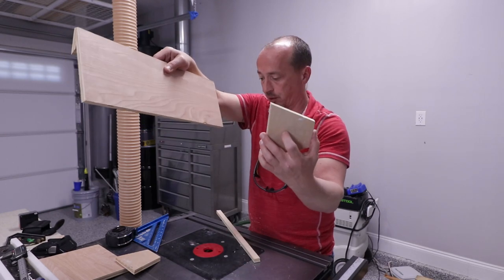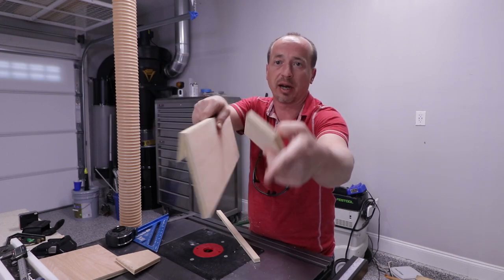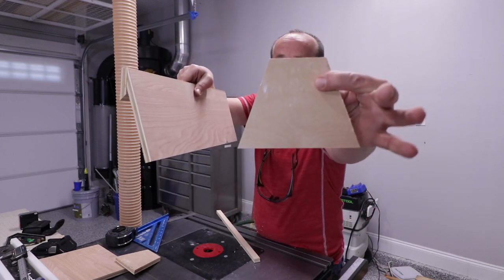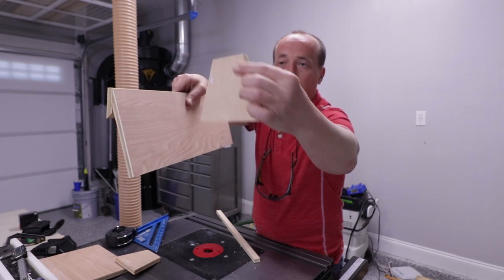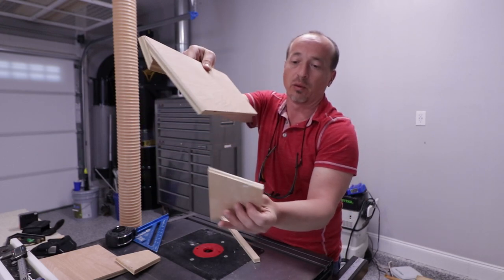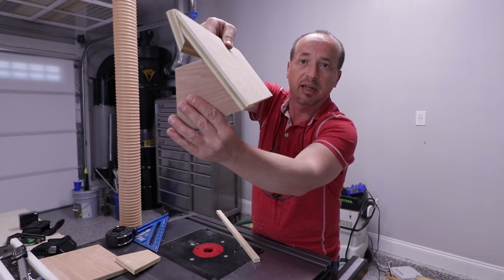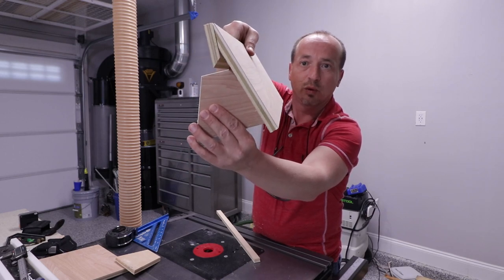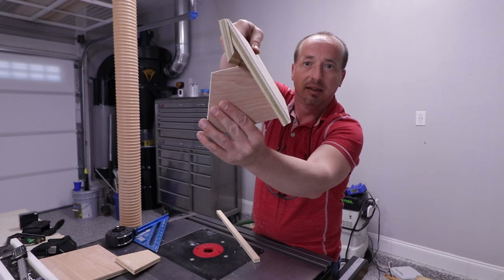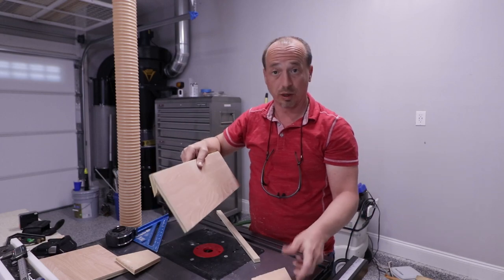So what I did is I cut a couple little sections right here. This was on a 20 degree angle, this cut right here that I had made, that long rip cut on an angle. So what I'm gonna do is this section, I made two 20 degree cuts over on the saw real quick. On this section right here, this is gonna get actually cut. So what's gonna happen is one of each one of these reverse sections is gonna get cut to the back of that cleat right there. And then I'll have supports to hold it out away. So I'm gonna do that real quick.